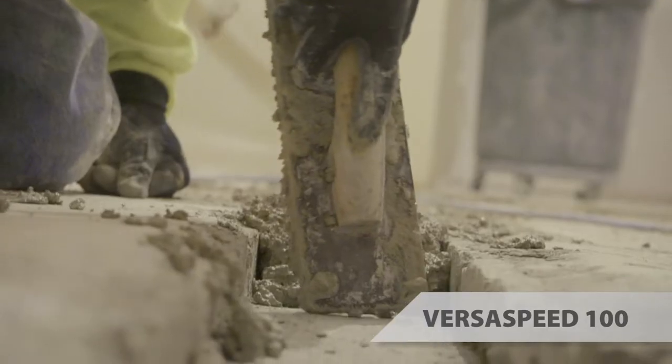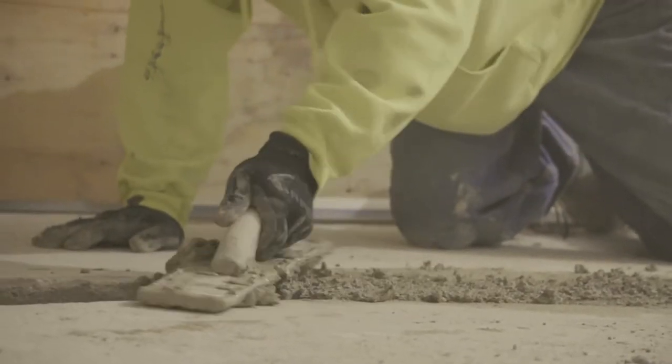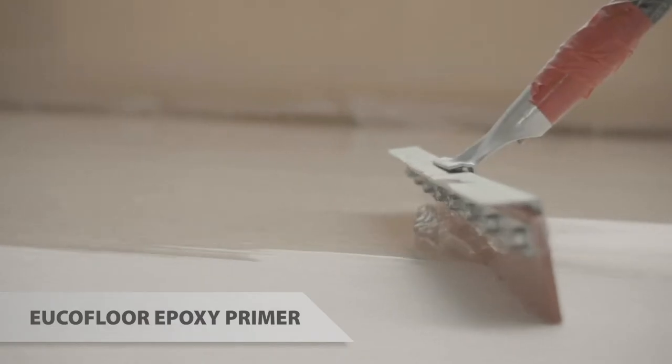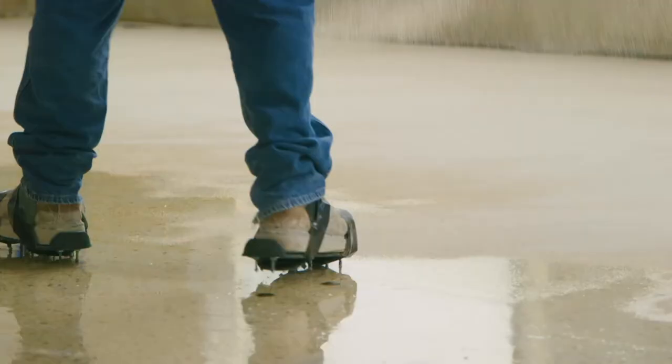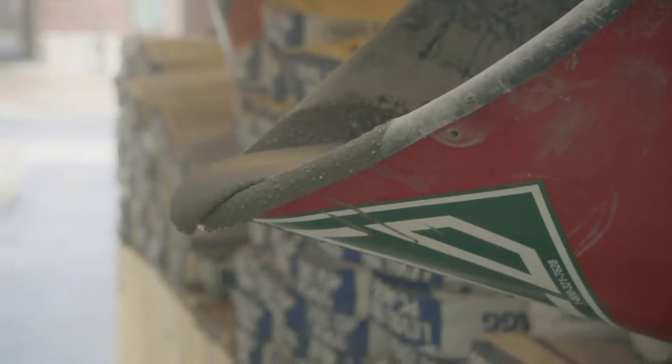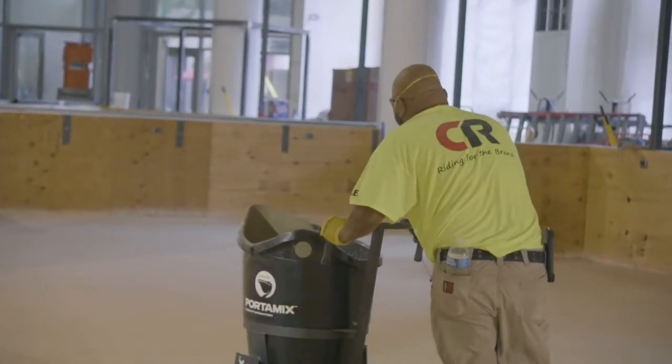Within 16 hours we're able to get on the floor and start the grind and polish process. We come in and fix any patching areas that need to be up to par, put an epoxy with sand to give it a solid substrate to adhere to. Then we gear up to do the actual pour — setting all of our edge forms, anything that's not going to terminate up against the wall to that half-inch elevation.